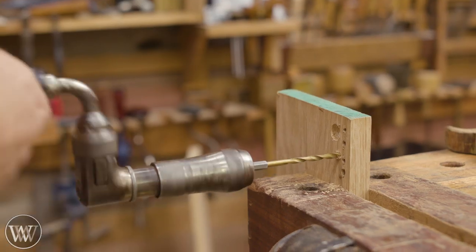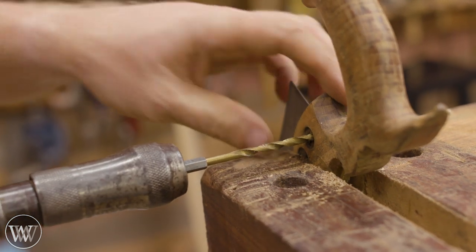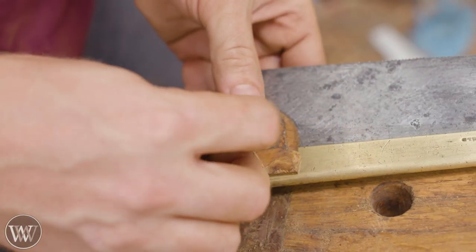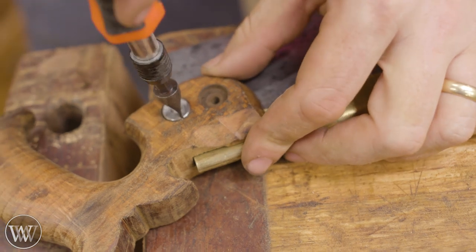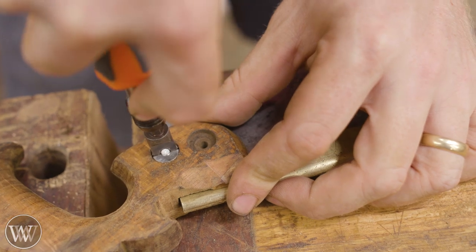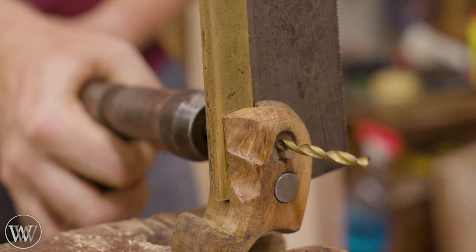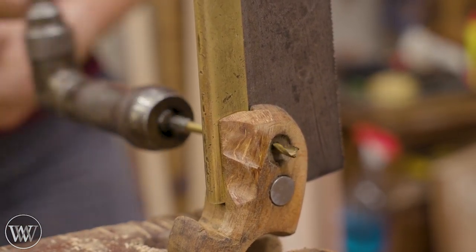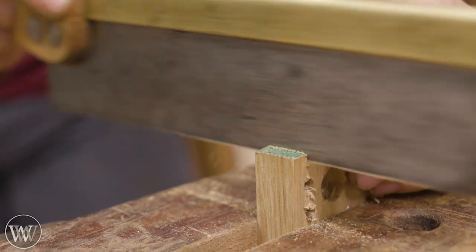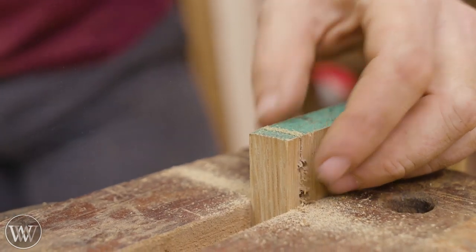I need to test the holes I need to drill because I need to enlarge them ever so slightly for the nuts. The nut set I got was from Tools for Working Wood — I'll leave a link below. I got the steel ones; I was originally thinking about getting brass but I kind of like the look of steel and I wanted to indicate these are not original. But I love the look of the split nuts on here. So I drill them out, test it — put one through, lock it down, then drill the second hole, making sure it is a nice tight fit. We do not want any slop in these; the hole should be exactly the size of the bolt. Now that we have the two nuts in there we can take it for a test drive.